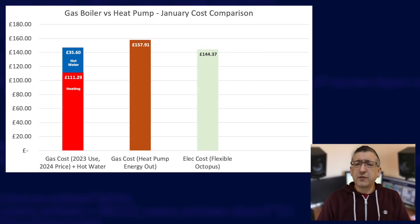Comparing that to how much the same energy would cost at the flexible Octopus electricity rate of 28.71 pence per kilowatt hour — that works out at £144. So there's a slight saving from using the heat pump over the gas boiler, and importantly they are roughly similar. This isn't the Rolls Royce of heat pumps — it's a budget installation — but it's still clear that it does not cost more to run than a gas boiler; in fact it would be very slightly cheaper. This is also the maximum it would cost to run, because with a heat pump you're really best off switching to a smart tariff with cheaper rates at certain times. Octopus Cozy could reduce that monthly cost further. I use Octopus Go because I have an EV, and I also have home batteries that I charge off-peak, meaning the majority of my heating uses off-peak rates.